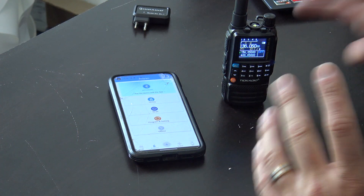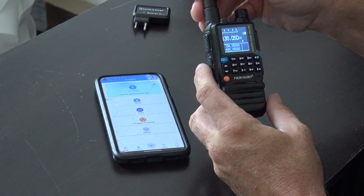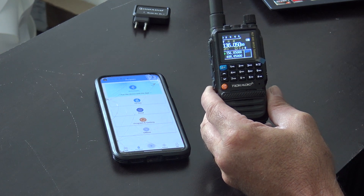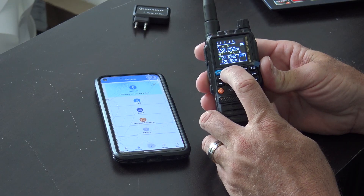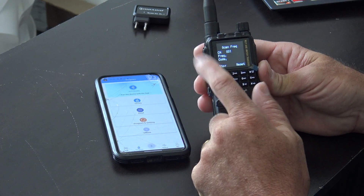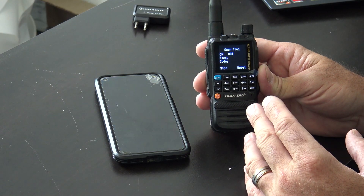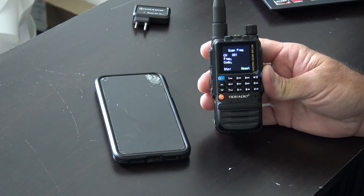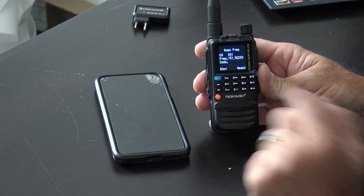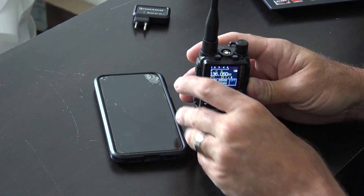So let's talk about just some of the features of this again. For the price point of this radio, little compact thing, dual PTT right here. This version compared to the original one has a backlit screen and backlit keypad, so if you're in the dark they made this backlit. They also added Bluetooth cloning. And also if you hold number one — watch this — you can actually scan for a radio that is transmitting nearby and find the frequency and tone of that radio right here. Some higher-end radios on bigger markets don't even have that function. If you're around somebody and they're using a radio and you don't know what frequency they're on — maybe somebody programmed it for them and they don't know — you can find it right here, then store it. We're finding 151.9225, which might have been somebody nearby on business band.